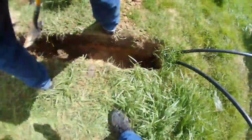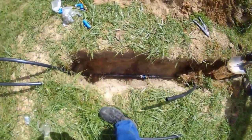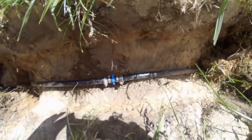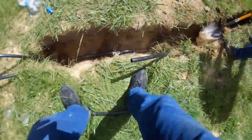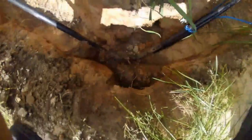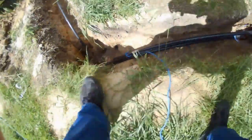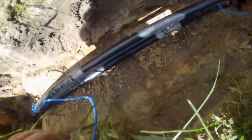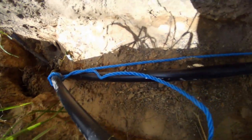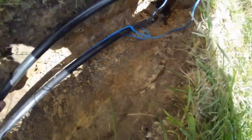Once all the wells are in, the only thing you have to do is hook the wells together to create the circuit. Excess pipe is more than enough to reach between the wells. You install the unions, double clamp them, and you're ready to go. It's always great to have a buddy come over and do some of that digging for you — it's my least favorite part of the whole job. But it's not all that bad. We dug them to about two feet down, just to keep them out of the frosty area. Of course, the greenhouse can be on top of it anyway.